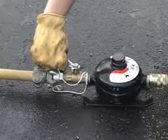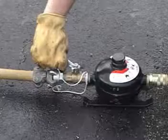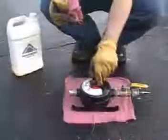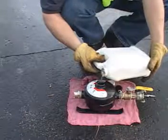Before filling or adjusting the oiler, turn off the air compressor and bleed off the air pressure. High-pressured air trapped inside the oiler may force all oil into the airline. Do not overfill the oiler. A small airspace is required for the oiler to work properly.